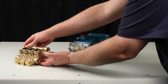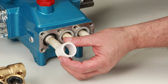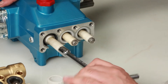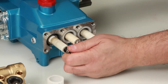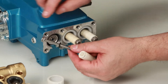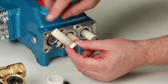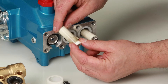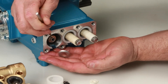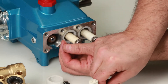Before reinstalling the manifold, be sure to replace the plunger retainer gasket included in the seal kit. Begin by removing the seal retainer, which has two holes — one with a tab that is installed facing down into the slot of the crankcase. Using a 10mm wrench, loosen and remove the plunger retainer and plunger. Inspect the plunger retainer gasket for nicks or tears, then inspect the ceramic plunger for cracks or scoring to the surface.